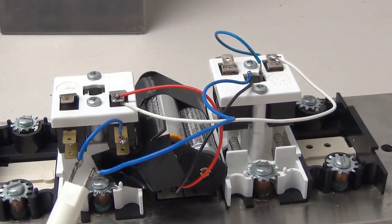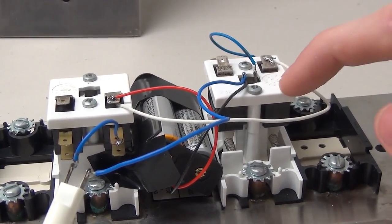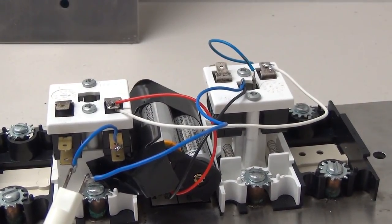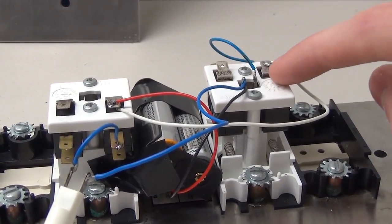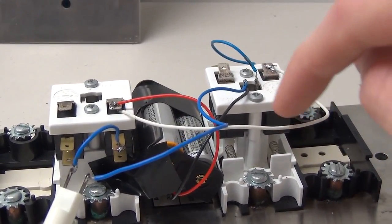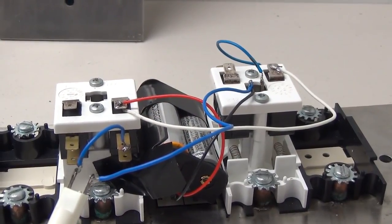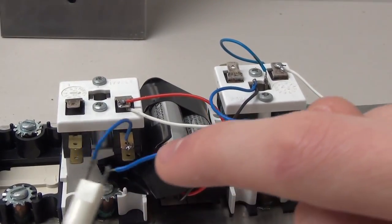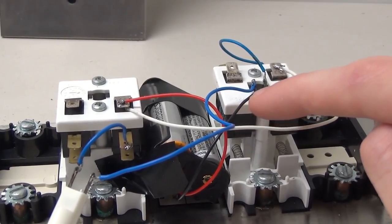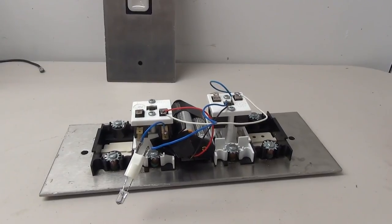Now what if you have an intermediate call station — how can you wire this up? Basically you want to wire the other button the exact same way as this one, but this time instead of soldering the red wire from the battery pack onto the top pin of that button, you simply take a wire, bring it from that pin, and connect it to the same pin that has the red wire. The same thing goes with the negative — this blue wire goes over to the same pin that the black wire on the battery pack is connected to.